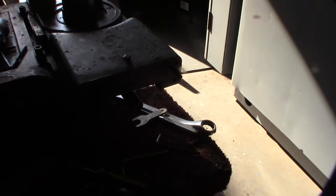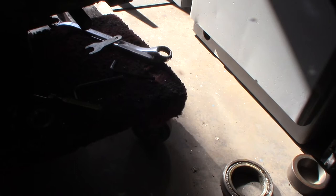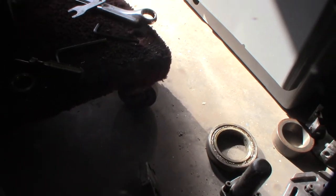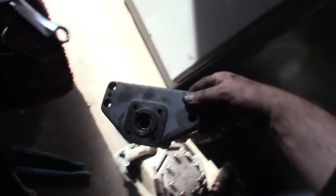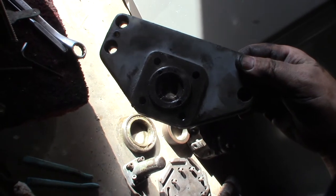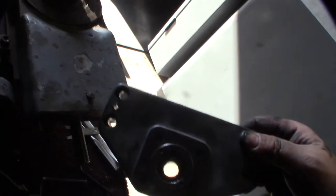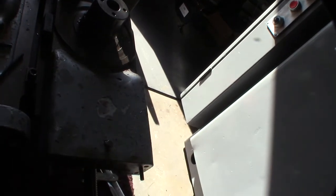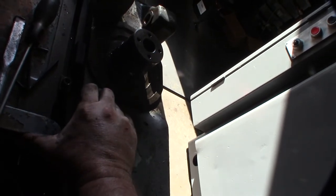I got the rear cap off - keeping all the pieces together. It looks like a brass or copper nut - that's a consumable that wears out before the lead screw does. This looks to me like it does the same function as a ball nut on a ball screw - it basically holds the axis in place and this is where the thread engages. If you're going to have any backlash it's going to be in here. Without that piece in there this thing just free-spools, so now I gotta figure out where the end stop is.